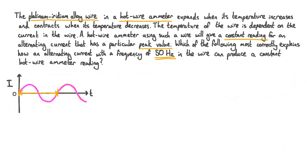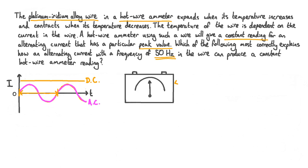Attempting to measure the size of a current like this is much more challenging than measuring a direct current, which stays at a constant level in one direction. To measure a direct current, it's common to use a moving coil ammeter based on a galvanometer, in which the magnetic field produced by a current causes a needle to deflect by an amount proportional to the size of the current. This works great for direct currents; however, a galvanometer effectively measures the magnetic field produced by a current, and if the current is rapidly alternating, then the magnetic field will alternate at the same frequency. Connecting a galvanometer to an alternating current source causes the needle to fluctuate rapidly from side to side, making it essentially impossible to obtain an accurate reading.